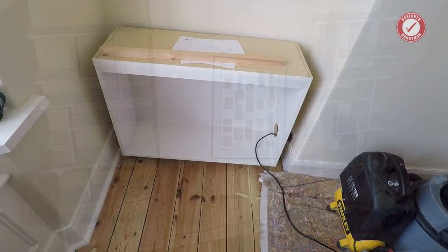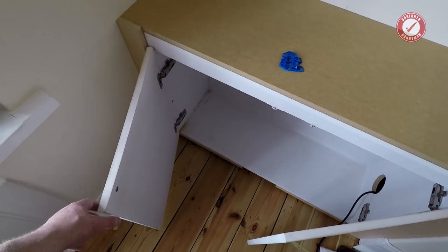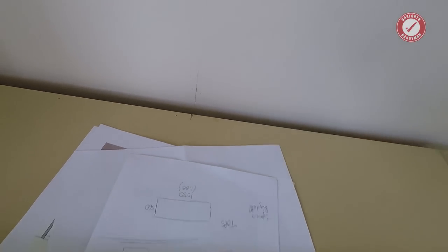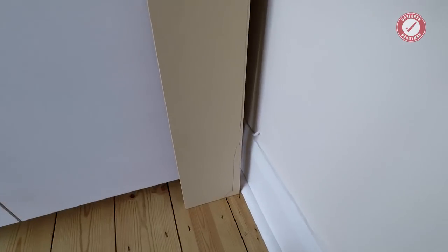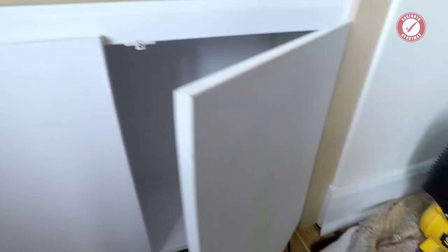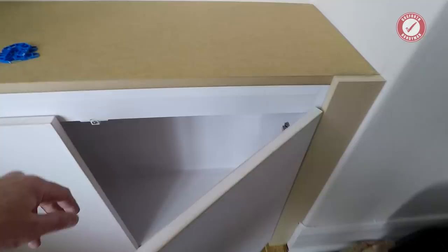First part of the build is the lower cabinets. They're just really straightforward cabinets with push-to-open doors. I used adjustable feet to get everything to the correct height and level. They're then held against the back wall using space plugs — I'll leave a link in the description. They're then trimmed up with 18mm MDF all the way around and scribed to the walls and around the skirting, cut perfectly flush to the top surface so once it's painted you can't see any transition between the edge grain and the face grain of the top.